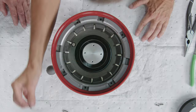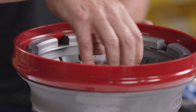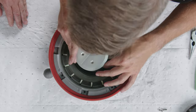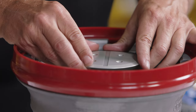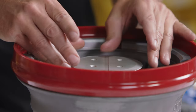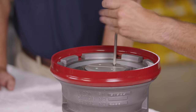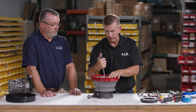Install the poppet O-ring into the linkage groove, then install the poppet with holes aligned to the screw holes in the linkage. Apply even force and push the poppet down until it pops into place. Reattach the poppet screws using a Phillips screwdriver in a star pattern until snug.